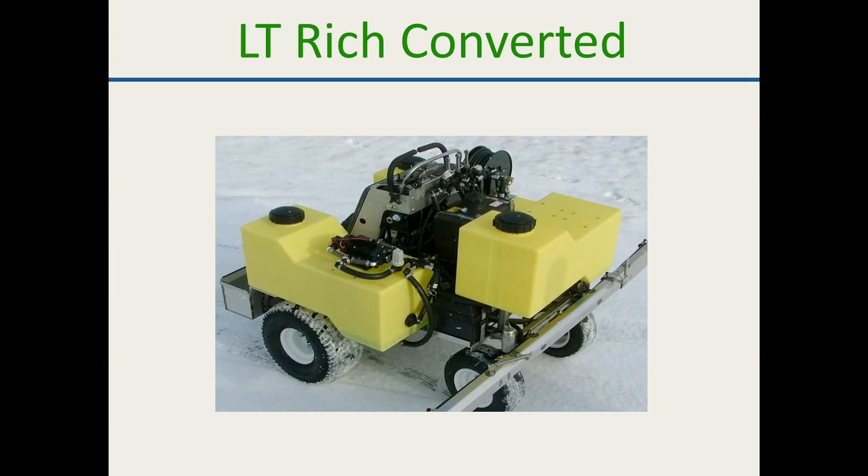The LT Rich we've had a lot of good luck with. For around $800 you can convert your old intermediate or max machine. They have a spray-ready rig — the first time takes about an hour and a half to convert. You're changing the pump, the tips, unbolting four bolts where the hopper goes. On the max you can get up to 75 gallons; on the intermediate, 18 plus 25 gallons. After the first time, converting back and forth takes about 20 to 30 minutes.